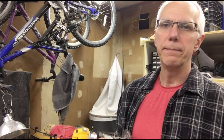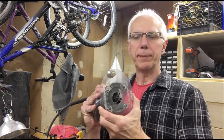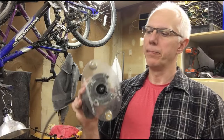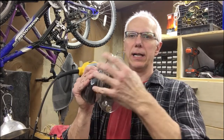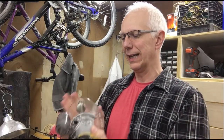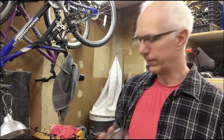I don't have to worry about eye protection as much — although I still wear my glasses, very little is coming out in my face. The other thing you'll notice is this is not the stock base plate. The stock plate is just a little D-plate with a flat edge, rounded on the other side. I got this from makeawoodsign.com, and this works out really great. I think this is probably the best thing you could do for yourself — to have a base like this with a couple of handles so that you can rest your wrist on your workpiece and move it around. You have a lot better control this way, and you can use whatever brand router you want.